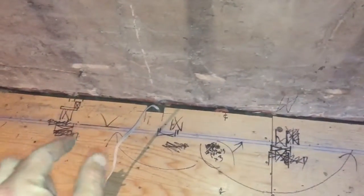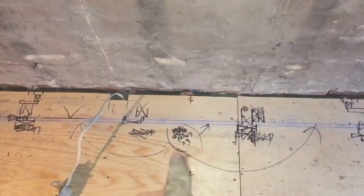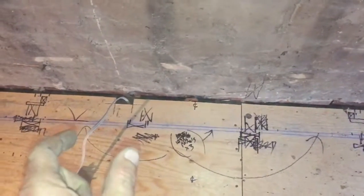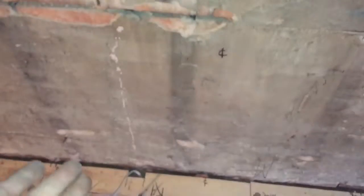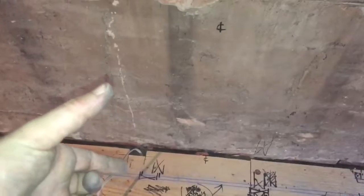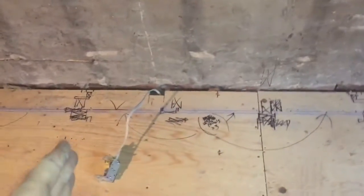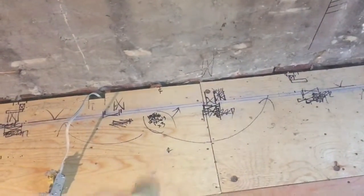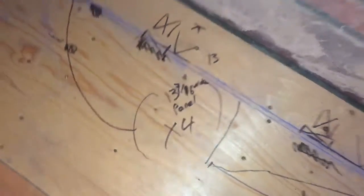Now again, that's not including the bit of panel molding that's going to go around that, so you won't actually see 12 and 9/16. You'll actually see 12 and 9/16 minus the thickness of each of those pieces on either side, and then when we're doing the horizontal pieces, it'll be whatever the height of the panel is minus the thickness of those little trim pieces. So in either case, underneath the window, there's going to be 3 panels at 12 and 9/16, and then on both sides, because it's centered, I was able to get 4 panels of 13 and 7/16.